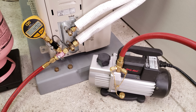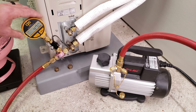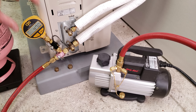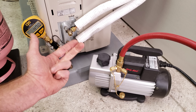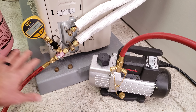Hey guys, this is Craig Miglaccio with AC Service Tech. Today we're going over how to vacuum a mini-split unit down below 500 microns in preparation for adding refrigerant from the bottle or from the service valves. I'm going to show you how we got to this vacuum level during the standing vacuum test, because this proves that there are no leaks, no water, no air, and no nitrogen in the system. So this system will be ready for refrigerant.